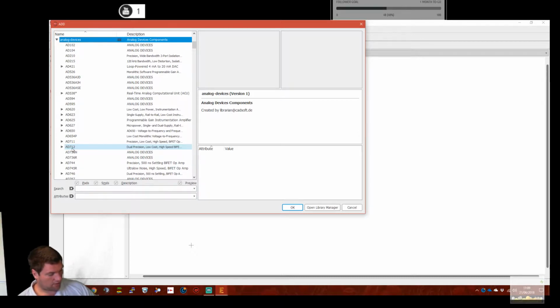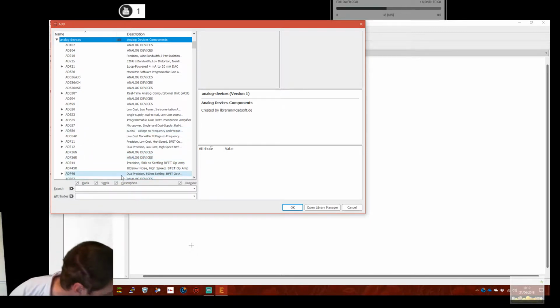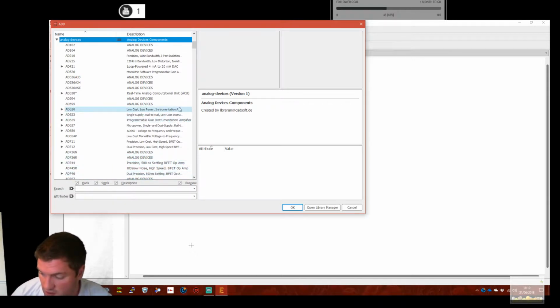But the risk there, of course, is that you could end up with one of them at 0 and the other one at 5 volts, and it would have blown before that because they're not balanced. Because these are sold in a packet, they probably are matched, so the chance of that is reduced, but still exists. But anyway, our ones that we do go somewhere between 6 and 8 volts for a single cap.